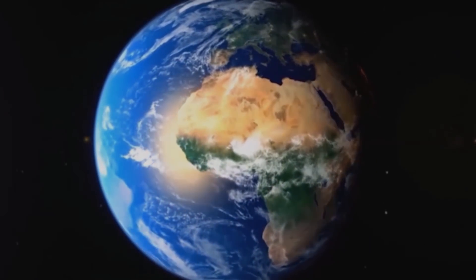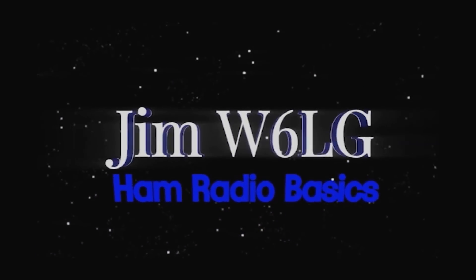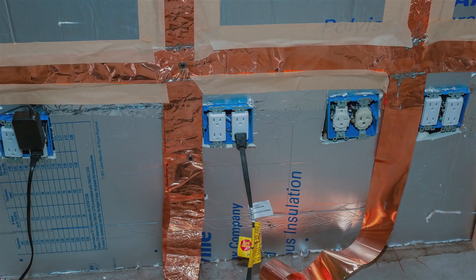With respect to this room, I'll go into greater detail right after this. I did some unusual things and you may or may not want to try them. With respect to the ground strap, an RF ground is different from an AC ground. So I ran a separate RF ground using copper strap. The reason why I did that was I had it — it had been on the shelf for probably 10 years. It's a large roll, it was real expensive, relatively thick, and I just applied it and ran it out. If I hadn't had it, I would still have used a copper strap, but probably not as wide or not as expensive for sure.